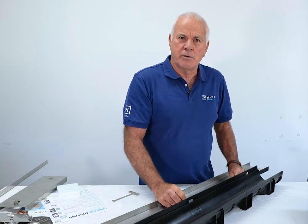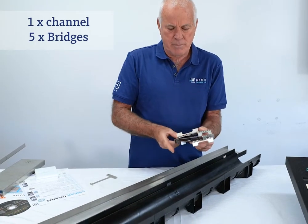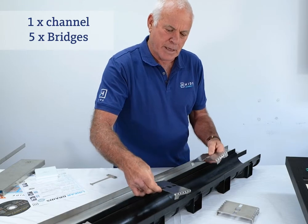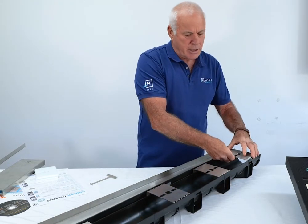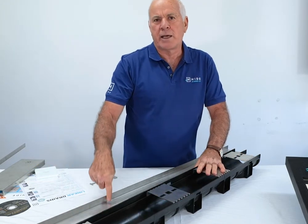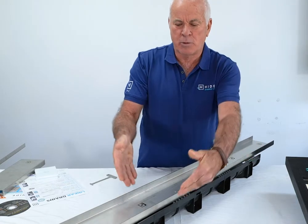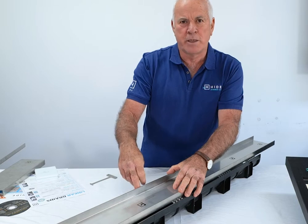Let me show you how this is going to fit into there. With the channel comes five bridges. These five bridges are going to slot within the black channel. These bridges are actually mounted at the same height as the slab, or a little bit lower, to allow for a little bit thicker tray. The tray then sits on top of these bridges and will allow the gap and clearance either side for the water moving down into the channel.